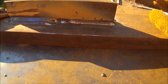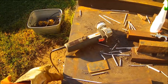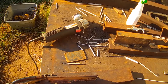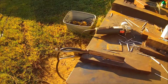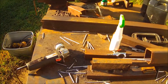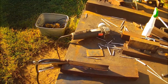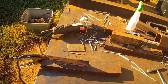People run these little machines down — duty cycle this and that and yadda yadda. If you really sit and think about it, just how much are you welding? With 3/32nds you're probably going to get about a 50 to 60 percent duty cycle — that's five minutes out of ten. If you're building something, you're not going to be welding five minutes straight. You're going to be doing fit-up, grinding out welds you don't like. Five minutes out of ten is plenty, and you just don't need to be plunking down hard-earned cash for these fancy machines.